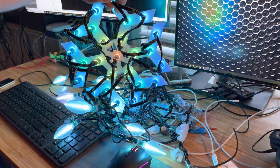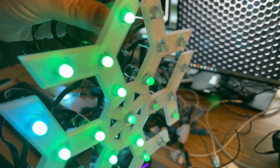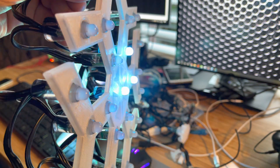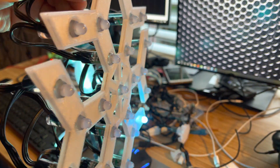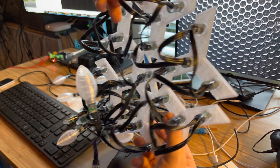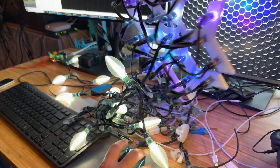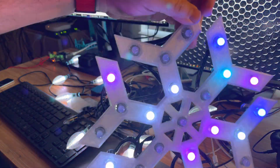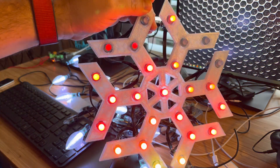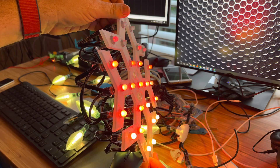Running at 30% brightness is to save power, but predominantly to save having to run as many power injection strands on the pixels themselves. This is the 5-millimeter thick prop and I was curious to see how much it lights up on the sides, and whether 5mm is thick enough to hold the pixels sturdy. So far it looks like this custom-printed one at 5mm is holding them quite effectively. I'm going to try two-and-a-half millimeters as well as 10 millimeters to see how much difference there is.